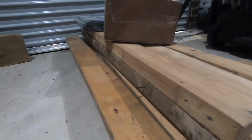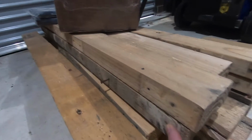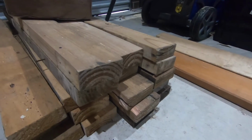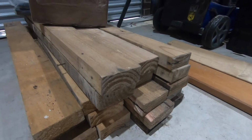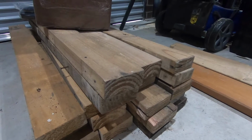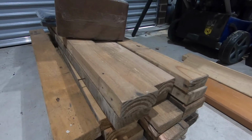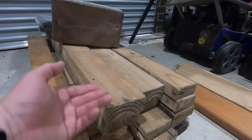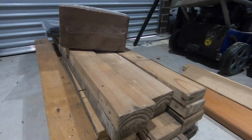The problem with that method is that it leaves the nails cut off inside these larger timbers, 2x4s, for real 2x4s, not dimensional 2x4s, which are obviously smaller. To get around that, another way is just use a circular saw and slice alongside the rails.